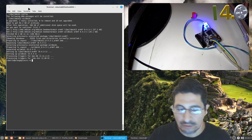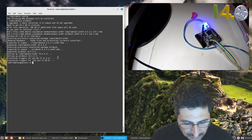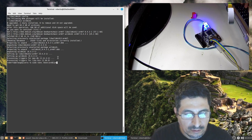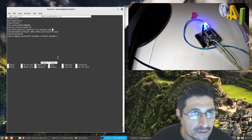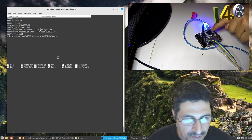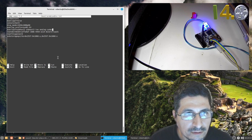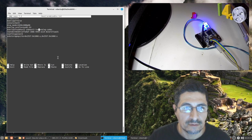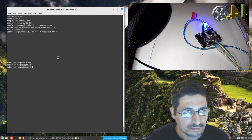First I'll show you here what file is critical to enable video. If you type sudo nano armbianEnv.txt, then you can scroll down and see TVE. This is what activates the TV encoder inside the H3 chip. And also add this word, analog codec, and that will enable the digital to analog converter inside the H3. Let's exit with Control X, don't save it.